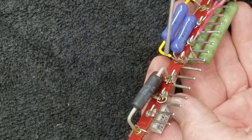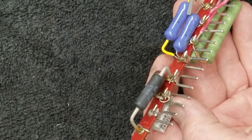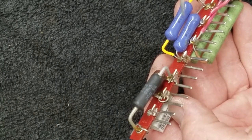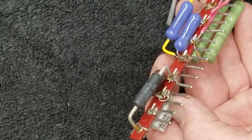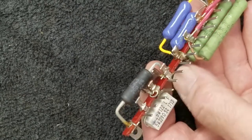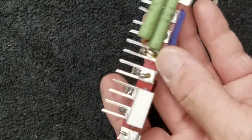I have two 20ks in parallel and according to everything they taught me in engineering school, two 20ks in parallel really is 10k. And I have the added bonus that I've actually improved the power dissipation capabilities of this 10k. The 10k goes off to ground potential.